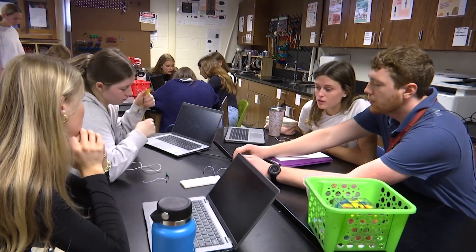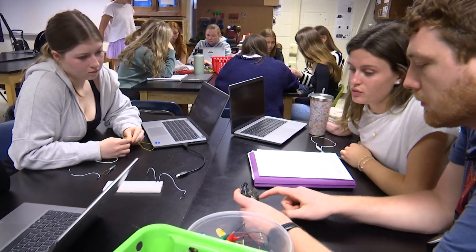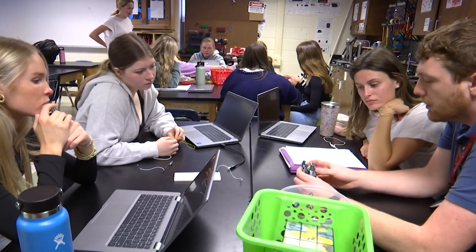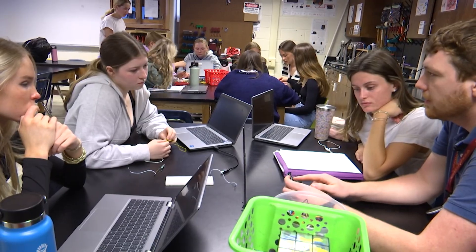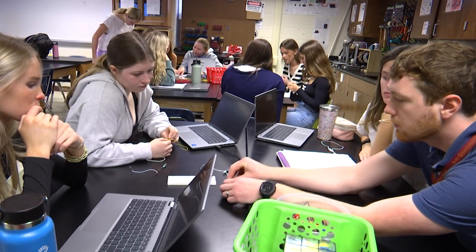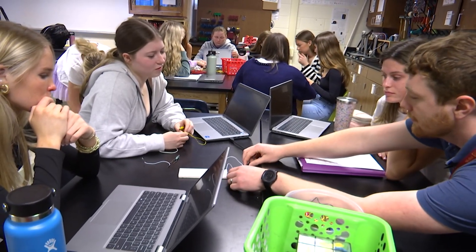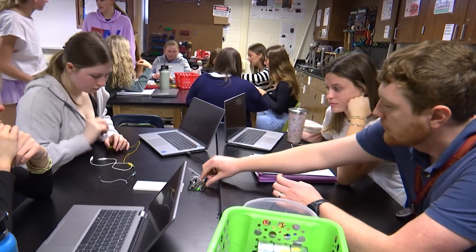Let me give you a brief overview of how this thing works. This side that says 'digital' — that's the coding side. Over here where it says 'power' is the basic intro side. There are really two you want to worry about: ground and five volts. Five volts is like the positive end of a battery; ground is like the negative. So instead of hooking in over here, we want to plug these into one of the five-volt pins, and we'll get another pin and plug it into ground. Now try hooking that up to a light and see if it just works.